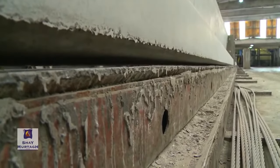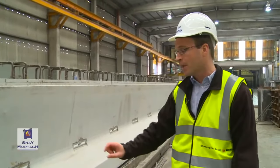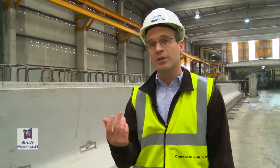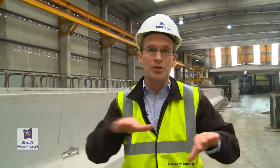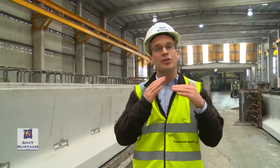The beam will actually lift up several millimeters, 10 millimeters, whatever the case may be, depending upon the beam and the pre-stressing amount and layout used. It will actually camber up. Now this is beneficial with regard to deflection checks as well. Generally for bridge beam design, we don't need to carry out rigorous deflection checks. But from an aesthetic point of view, you don't want a beam visually sagging on site. So this natural camber that results from the pre-stressing operation itself will help eliminate the potential that that beam would be visibly sagging on site as well.